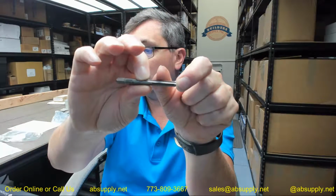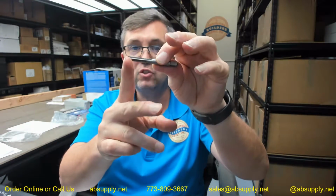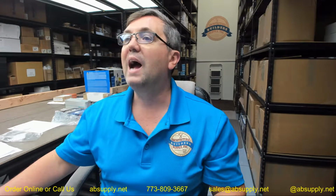Well, actually, a plug style is for general purpose and is the most common sort of application. But a taper tap would be really good when you've got all that chamfered length to get a nice clean start to something so that you're not immediately cutting threads as soon as you enter the workpiece. That might be applicable.